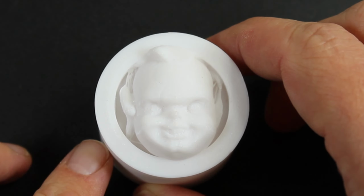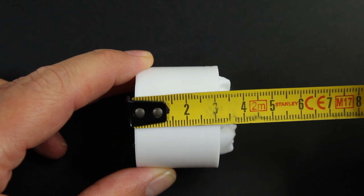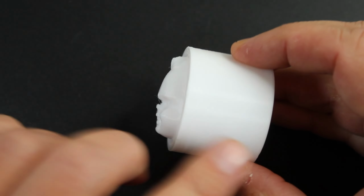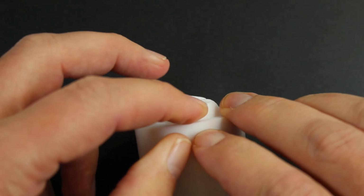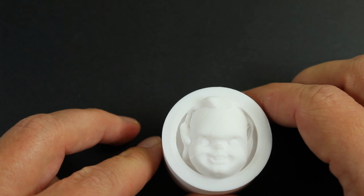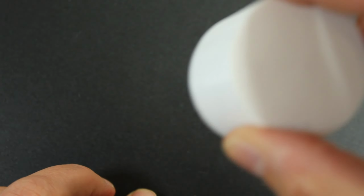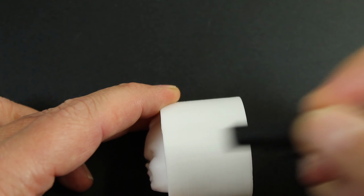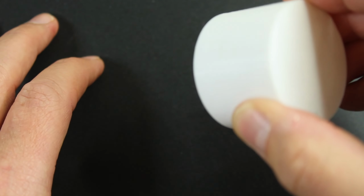But then I actually came up with the idea of doing it really, really chunky. That's 30 mil. That's 3 centimetres, 30 mil. Just so I can push it into the sand. This is experimental. We haven't tried this before. Normally we just do them probably like that thick, and then I have to play about with the sand. But with this, we thought, try and make my life a bit easier. I can actually push it in like that and then just pull it straight out. Because there's more to hold on to, and all I need to do is just mark on the side there how deep I want it, how thick I want the round. Stop at that point, pull it out.